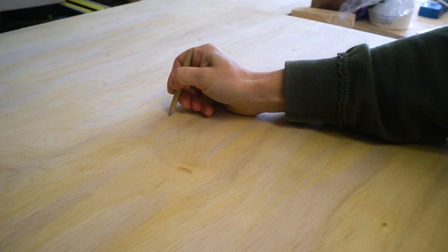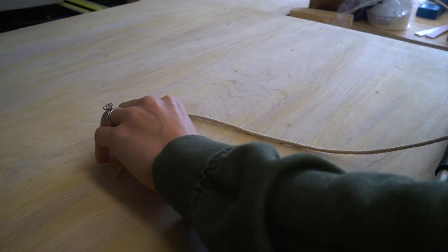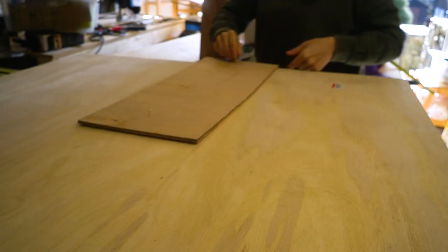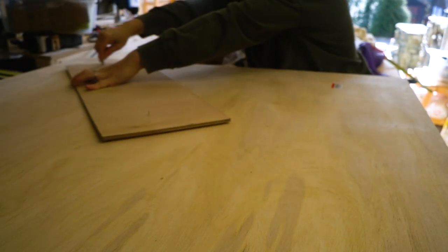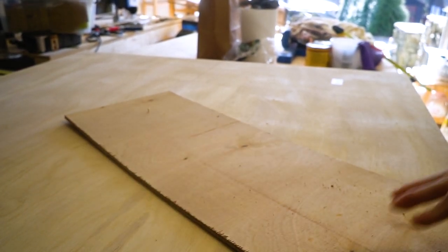When the plywood sheet was finally home and I started cutting the arch — a few months ago I already made half an arch for my pegboard room divider that you can actually see in the back. When I made that room divider I used a thread to basically trace a circle and cut it. The thing is, it didn't come out as perfect as I wanted, and yes there is no limit to perfection. So this time I decided to make an absolutely perfect round arch. I took scrap wood and measured the distance from the center of the board to the edge, then drilled a small hole on the scrap board at exactly halfway distance and put a nail loosely in the center — this way the pencil could trace a perfect half circle without wiggling off.